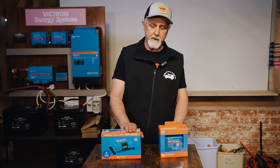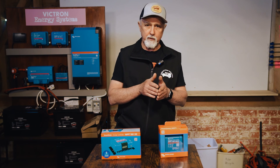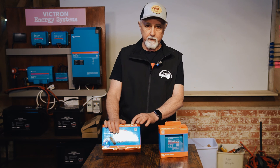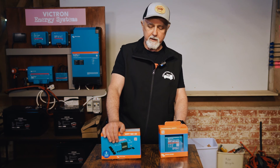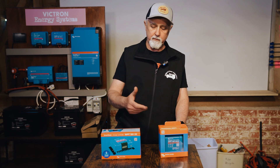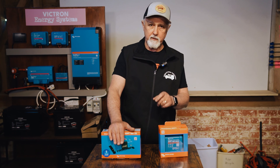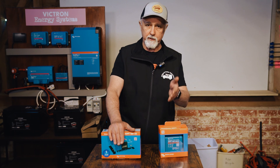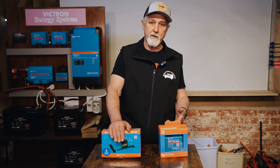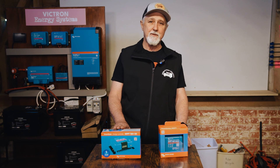Putting your panels in parallel means you won't increase the voltage — you increase the output watts and amps, but the voltage stays the same. That's a very safe approach, and the advantage is that if you shade one panel completely, the other still works. With panels in series you need to account for the increased voltage by adding all the voltages and building in that margin for error, but the advantage is that your cable can stay smaller since the amperage doesn't increase. Hopefully this helps you choose the right controller — see you in the next episode!